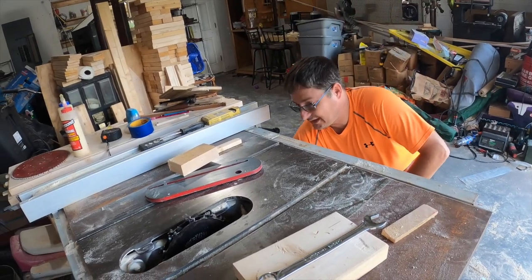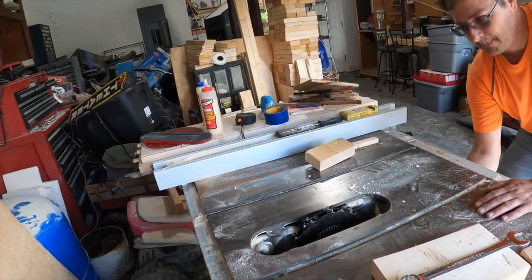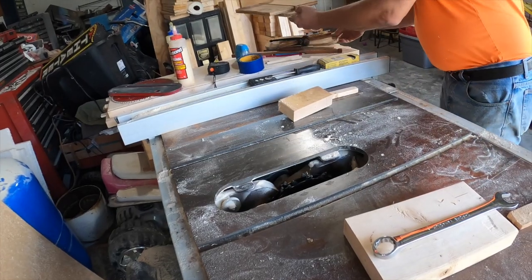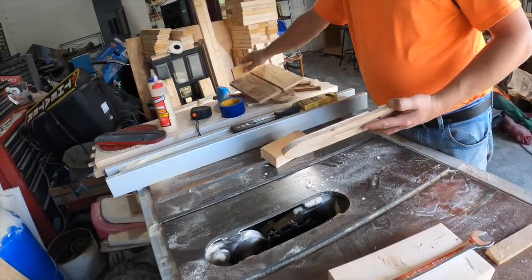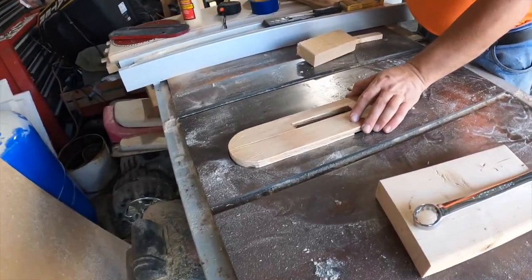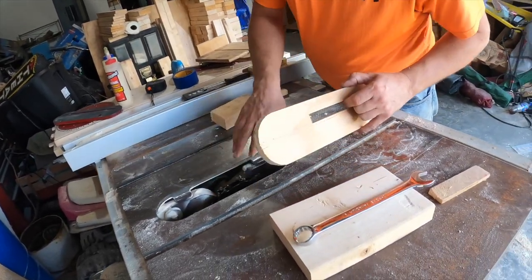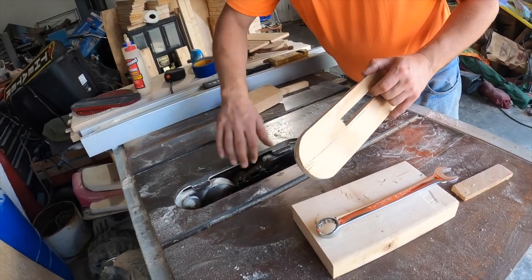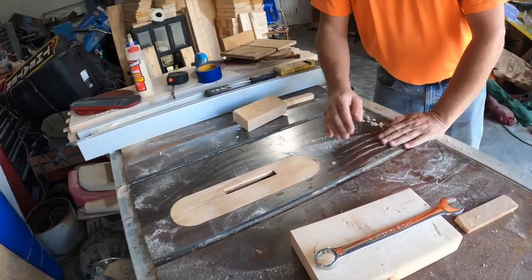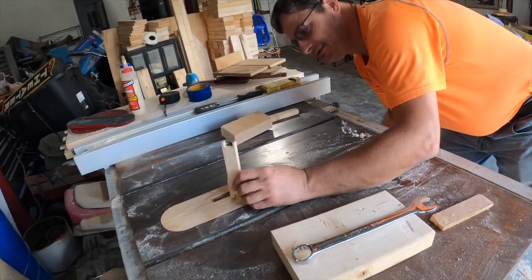We're at half-inch, five-eighths — I have another one here but I'm not going to use it because that would make it too big. We still put the outer blade on, and that'll give us our three-quarters of an inch. Put the washer back on — these are reverse thread, so it's not righty-tighty, lefty-lucy. Give it a slight tighten. Put the dado stack insert in — same as the regular one but without the extra material — and make sure your insert areas are clean so it sits fully flush.